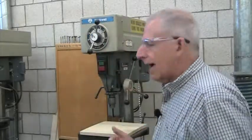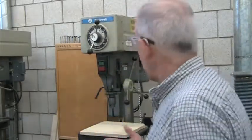Today's lesson is on the drill press, which has a lot of uses. Sometimes it's easy to just grab a cordless drill, but a drill press is good when you need a hole drilled at a very precise angle, exact depth, or when you have a series of holes to drill in a row where location is important. It also has a much larger motor than a cordless drill, so it's good for drilling large holes.